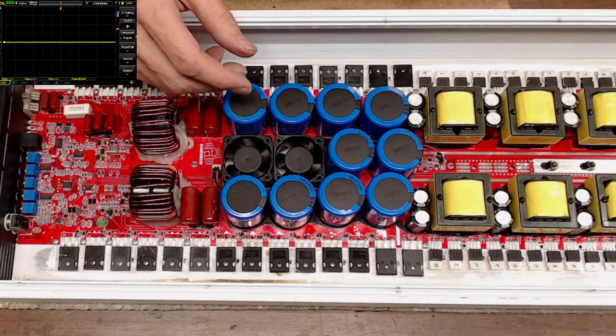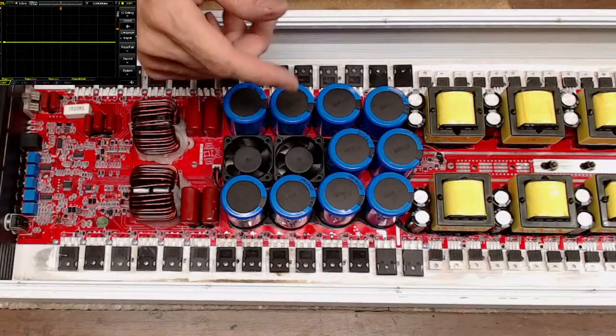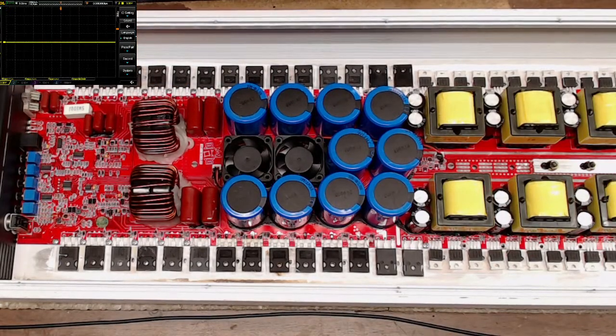Pin 1 is going to be an SI8244 IC, which, good luck finding them. They are difficult and very, very expensive right now, but you can find them. Like I said, your signal will be on pin 1 of those SI8244s. Being that this signal is on pin 3 of these C5 marked ICs, you're going to find that this is the IRS20957S IC. If you look up the data sheet, you will find that pin 3 is the input signal for that, and pin 1 is the input signal for the SI8244, which are two of the most common ICs used in Brazilian style boards.